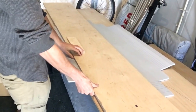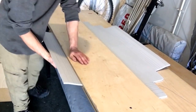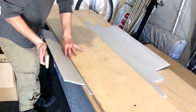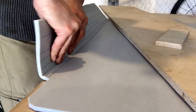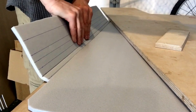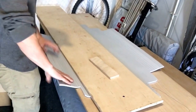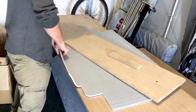You'll need to crease or crimp along the five inside lines around all four sides, lifting up slowly and gradually with a block until the flap is bent up at a 90-degree angle. You start on the inside line and work your way outwards. Once you have a crease, you push down and fold on the line until you force that 90-degree angle. If you can get someone else to hold the board, it makes it considerably easier, but you work outward each time on each of the five lines, repeating the process.